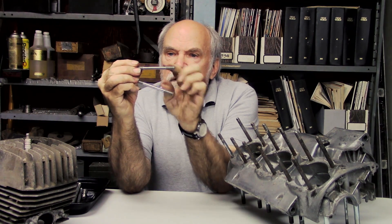The classical method is to turn down the thick part of the stud until it is as slender as the thin part, so that the lines of stress all go straight — they aren't trying to shoulder their way past a sudden reduction in diameter. This is a connecting rod bolt from an unknown BMW, and you'll notice that the middle part of the bolt is necked down so that the threads stick up from it. They had the same experience — they broke bolts, they learned to look in the engineering book where it says don't be a dummy, turn the center of the stud down. So I took all the studs out and turned the middle down to a smaller diameter using a round nose tool so that the transition at the ends would be smooth, as it is in the case of this BMW connecting rod bolt.